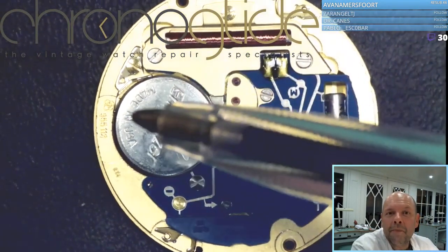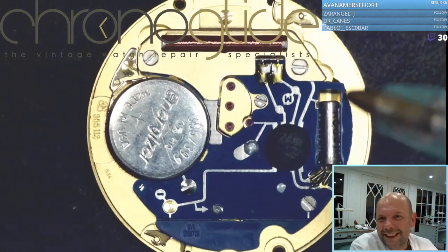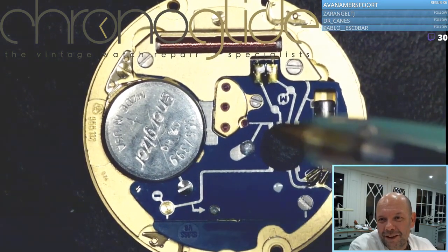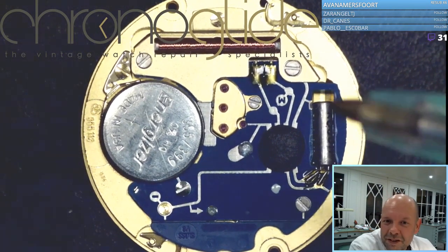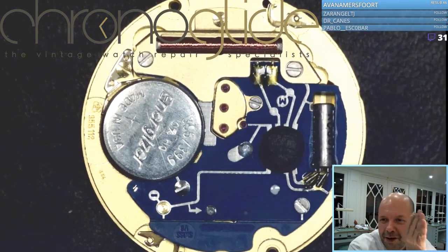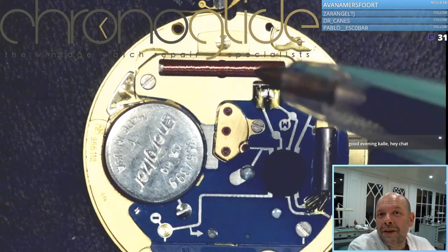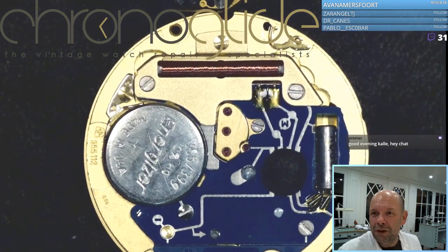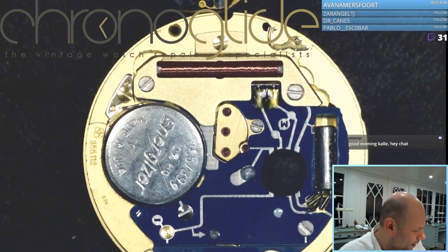So that happens here. Here is a battery, and that supplies a plus and a minus in voltage. Here is the crystal, so with the brains, the black blob brain. This one will vibrate always the same, extremely constant. And this blob will say once a second, it will give a signal to this coil. And a coil you can see as a magnetic switch. A magnet you can switch on and off. So a magnetic switch you can turn on and off exactly every second.